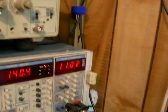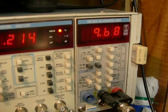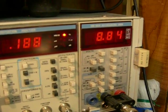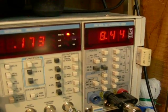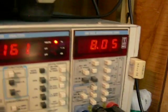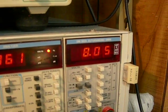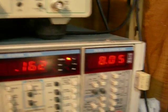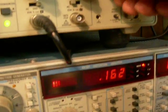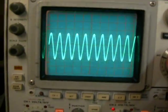For a good sanity check, we're going to go back to the kilohertz range and set our output voltage at 8 volts. 8 squared divided by 8 is 8, so we're testing it at 8 watts — a good listening level. Nothing is going to run you out of the room unless you're driving some really highly efficient speakers. At 8 watts, that's 8.05 volts squared divided by 8 — distortion is 0.16 percent at 2 kilohertz. Very good. And there's a very nice sine wave on both oscilloscopes.